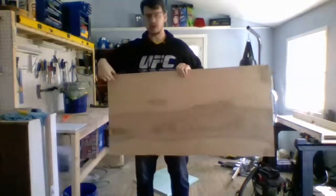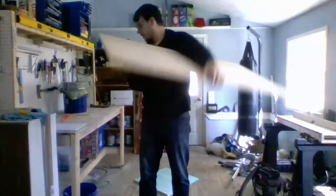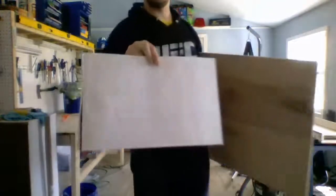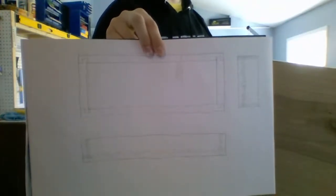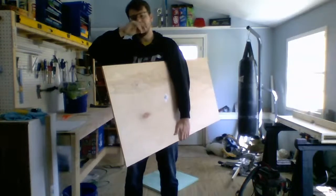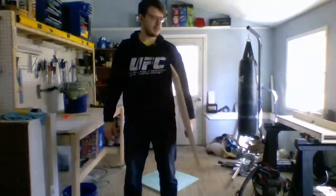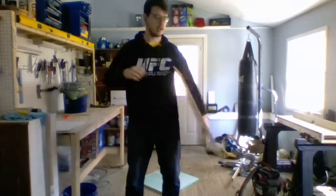So I'm going to take a 1.5 inch strip off the end of this piece of plywood. The interior dimensions of this is going to be 3 inches by 9 inches. When you take into account the width of the lumber, the pieces actually need to be 11 by 3.5. So that comes to 29 inches, which is obviously just too long for the 24 inch short piece. So I'm going to need to rip the entire length of the board. I'll have a lot of scrap left over at the end. But that's okay, because if this goes well, I can just make more, and I can use the leftovers on the second box.